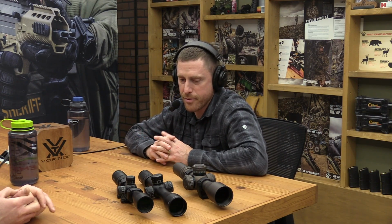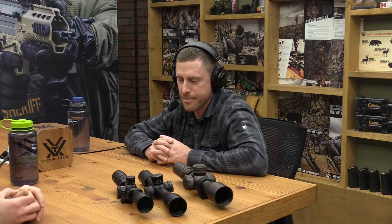Yeah, and actually, I just realized one micron off is not 33.3. I was thinking more 0.1 milliradian. So just to correct that, you don't have to be far off to be crazy far off on a reticle. On a 3 micron line width, if you're 1 micron off, it would be 33% off.